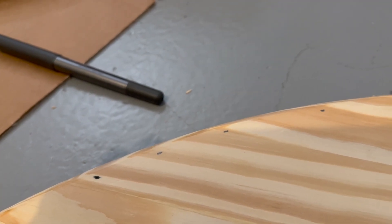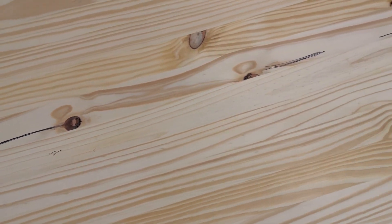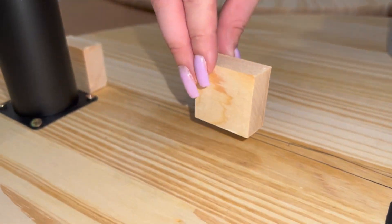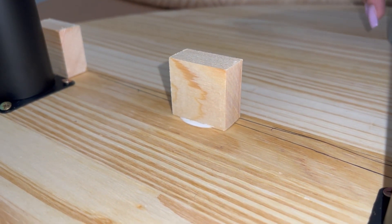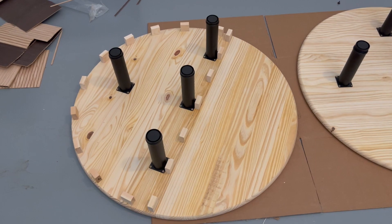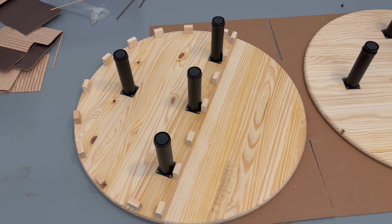You can attach the pole wrap to the supports that are 1/8 inch in, and it will be perfectly flush with the outside of the wood. You don't want to go all the way around the circle with these measurements — just around your supports. As you can see in the design, it's like a half circle on each level, so that's where you'll do your measurements. Once measured out, take your little pieces of wood and glue them into place all around the edge. Make sure these are very close together — we had an issue at the start where we didn't put them close enough together.